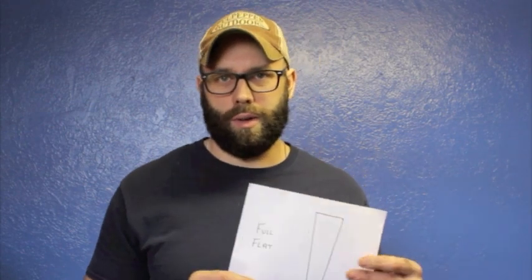Overall, it's just a very versatile blade grind. In my opinion, it's one of the most versatile grinds — you can use even a thicker blade stock or a thicker-spined knife, and in a full flat grind it'll still slice very well while having the strength that the thicker section affords it. I use it in actually most of my knives.